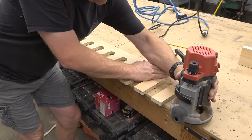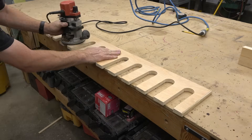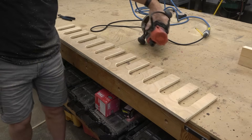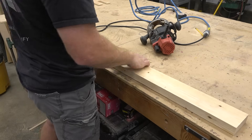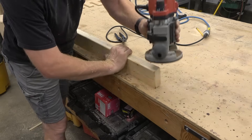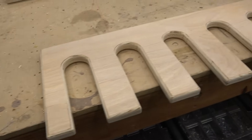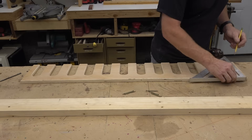I'm using a quarter-inch radius round over and I'm going to go over every edge of this front and back. I decided to round over the front facing corners of the support member also. It's important not to do too large of a radius, otherwise the smaller handled tools might slip through these gaps. The primary reason for a radius for me is to reduce the chance of splinters.